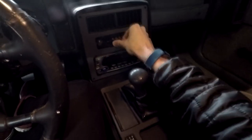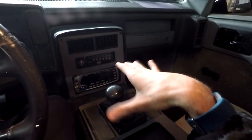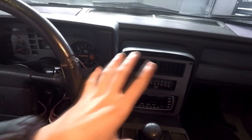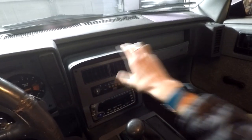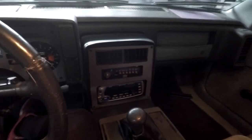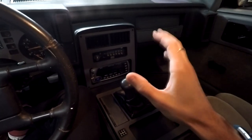The reason I had everything off was because this AC controller — imagine everything is bolted in completely in here — when you adjust the AC, the HVAC controls, it wobbled around this much. You're probably thinking, oh, maybe you just don't have something bolted in or something's not connected. The problem was that the inside of the plastic behind all this stuff — essentially this whole center stack is one continuous piece of plastic. There is a metal frame behind the upper section, but all that is just one big piece of plastic. You can't buy it from GM or anything anymore. Most likely if it's broken — which a lot of these are because it's very brittle plastic — you really just have to fabricate something to fix the issue. So let's go ahead and take all this stuff off and I'll show you guys up close and personal where the problem actually lies.